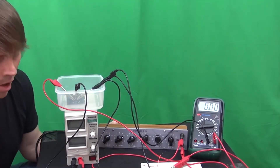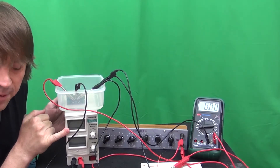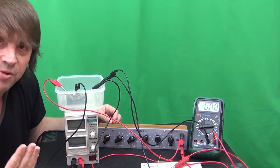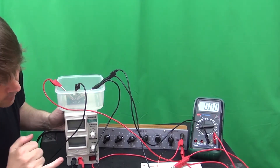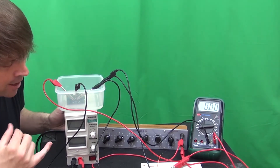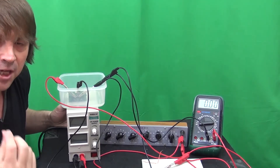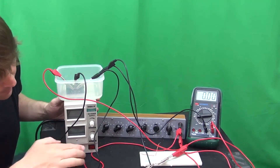So we're ready to do our test. I'm going to switch the power supply on — you will see the power supply set up to about 5 volts and it's drawing no current to start with. I'm going to start ranging down the decade box, and we'll see the voltage across the gate-source connection of the MOSFET begin to rise. When that voltage reaches a tipping point somewhere around about 3.5 volts we're going to see current being drawn from the power supply. There should be no change in the voltage initially, until we reach a point where the current draw is so large that the output impedance begins to take effect and we will see a small step change in the voltage. That step change and the current taken together can be used to calculate the output impedance.